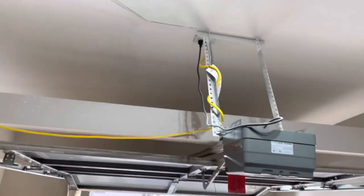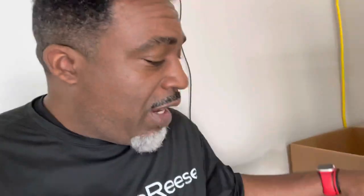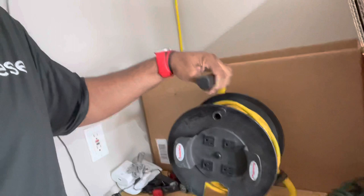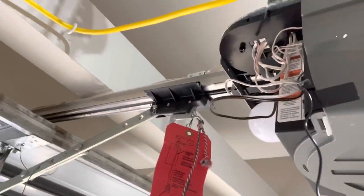The next thing was running the cable from there over to where the Tesla would actually charge. I tried a couple of different cables. First I used a standard outdoor extension cord — the kind you'd use for Christmas lights. That thing would get really, really hot. So I opted for a heavier-duty cord that has a built-in surge protector that trips at about 11.5 amps. But that didn't help the problem either, since the Tesla draws about 12 amps and kept tripping it. Ultimately I went on Amazon and bought a commercial heavy-duty outdoor plug that runs at 15 amps.